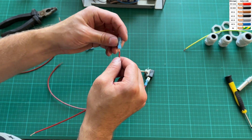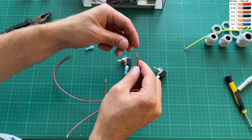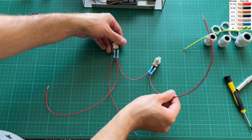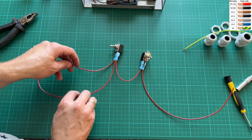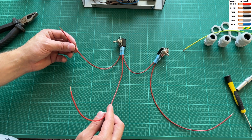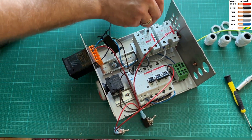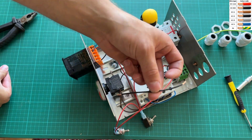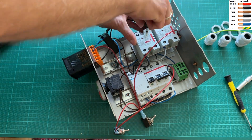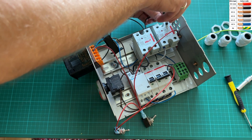So what I did is make a two-switch array. The first wire comes from the PID controller to the first switch. From the first switch, the output splits into two wires: one goes to the solid state relay controlling the left-side heating elements, and the second wire goes to the other switch, whose output goes to the second solid state relay controlling the right-side heating elements. The negative wire goes directly from the controller to the first solid state relay, and from there continues to the second solid state relay.